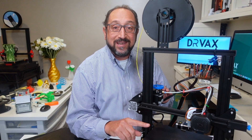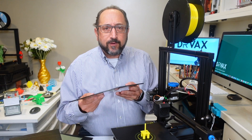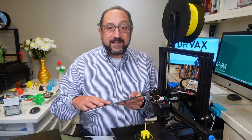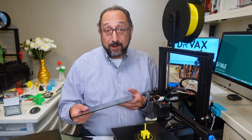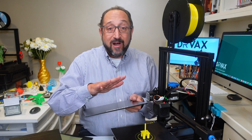The Ender 3 Version 2 ships with a new print surface from Creality. It's a sheet of glass — not flexible — with a coating bonded onto the top that you cannot peel off. I know that because I tried to peel it off to use other surfaces and could not. For one test, I actually put another surface on top of it. I've been okay with this new print surface; it tends to be very flat because it's glass. But adhesion has not been spectacular, and I'll talk about that specifically.